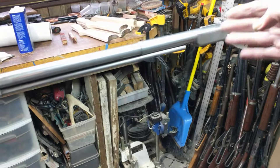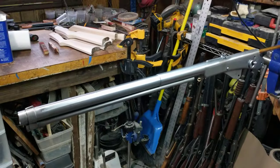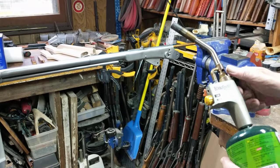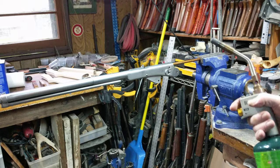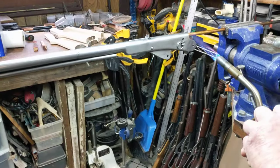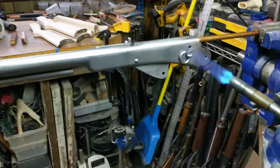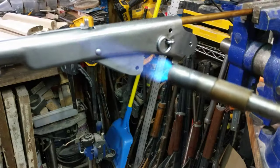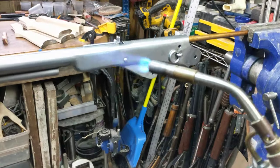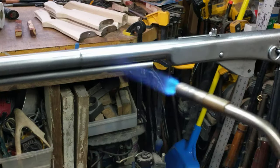So this is bright steel. Once you've got your surface prep done and wiped it with acetone or a suitable degreaser, it's time to grab your propane torch. I like this kind with a big bottle. Now it's going to get a little noisy. What we're going to try to do here is adjust our torch — we don't want it blazing hot, we want it about like that, with the tip of the torch out here. The first thing we're going to do is dry off the work. After you hit something with acetone and you've cleaned, degreased, and wire wheeled it a million times, you still need to run whatever latent moisture is on the surface off the surface.